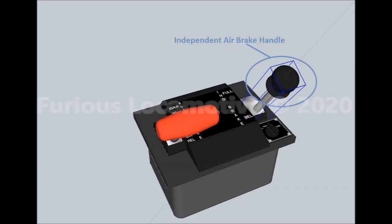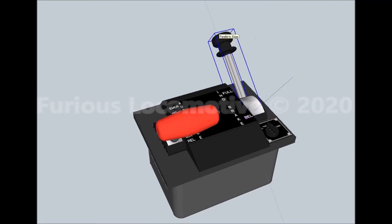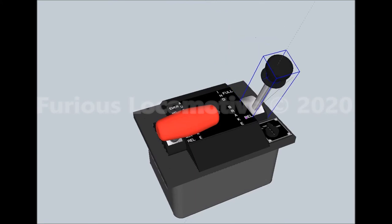The independent brake handle controls the application of brakes on the locomotive only. To apply the independent brake, move the handle away from the engineer. To release the independent brake, move the handle toward the engineer. The independent brake handle should always be in release position when the unit is in trail operation,